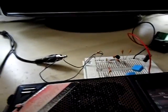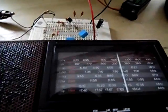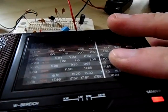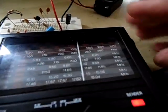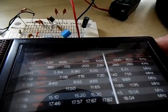Let's have a short listen to the audio quality of this transmitter. The audio quality is quite good. For those who know what I'm talking about, I'm showing you that it has good AM. I'm tuning over the band to show that the carrier frequency is stable and that only the amplitude is varying, not the frequency.